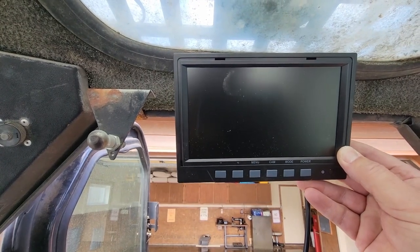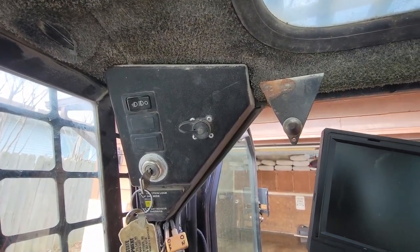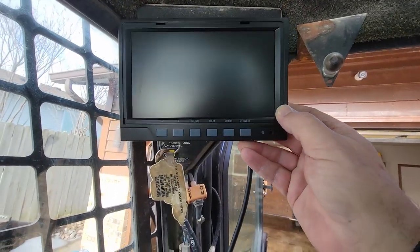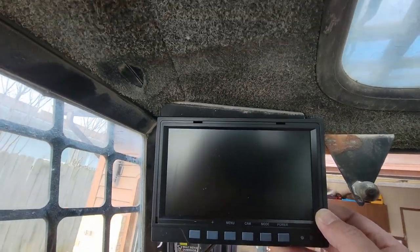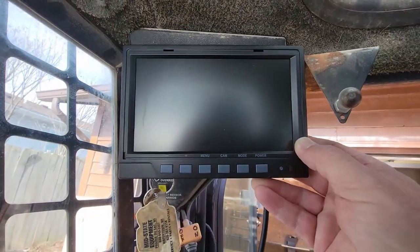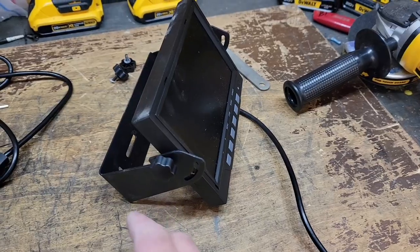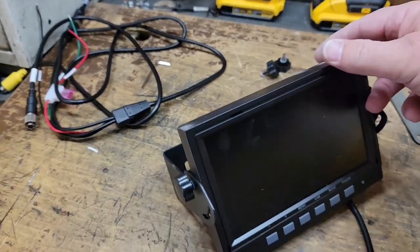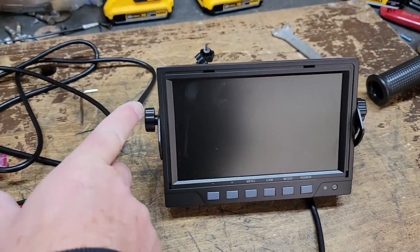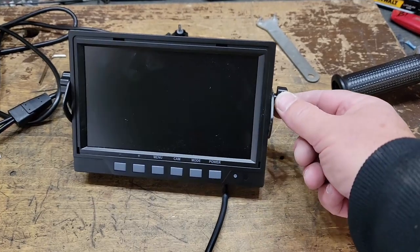There's no way this is going to work — you have to be able to get in and out of here. So I think what I'm going to do is, this is the bracket I put in for the mirror, I'm going to go ahead and cut that out, and that'll give me enough room. I should be able to get the monitor right back in this corner, keep it out of the way of the bar. When I swing it up, you can see the indent on the headliner there where the bar stops. I'll still have enough room to get the key in and sneak my hand behind there to turn on the light switch. This bracket goes back way too far, so I'm going to have to take a grinder and cut this off. Fortunately, this is wide enough that I can get in from the outside of the cab to screw this to the back of the plastic shroud in there, and this side I'll be able to just do from the other side of the cab.